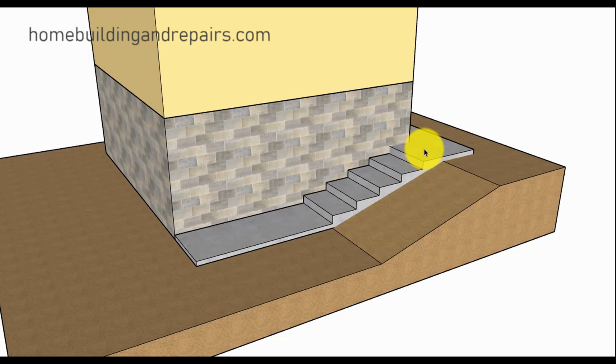I am going to make some more videos just to provide you with some different ideas. But the basic concept for something like this is just simply grabbing the length of the stairway that you need and dividing the steps up to be equal. And then doing the same thing with the risers, finding a height, getting the height of the soil at the top and the difference from the bottom. So the lower level subtracted from the higher level should give you your total rise.